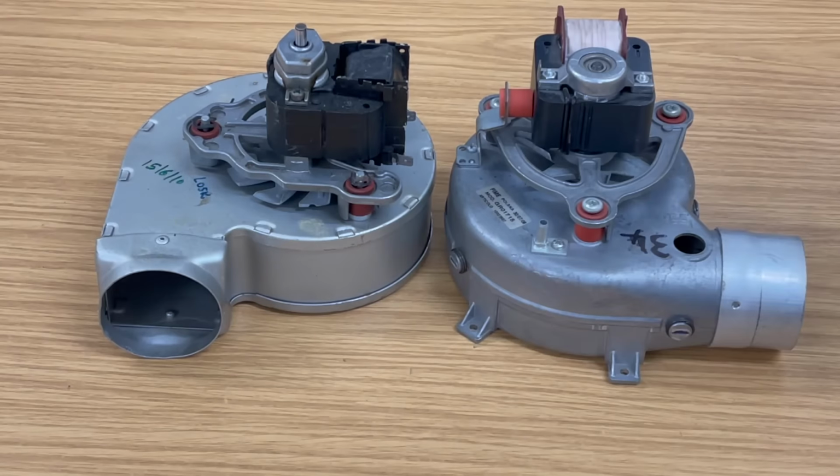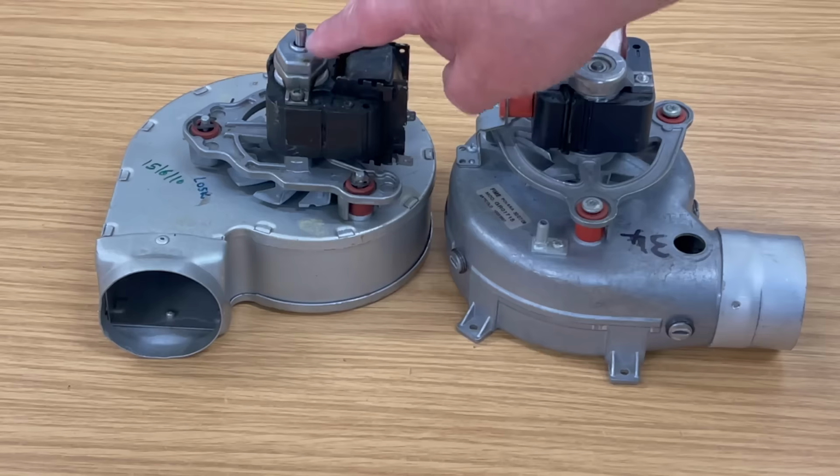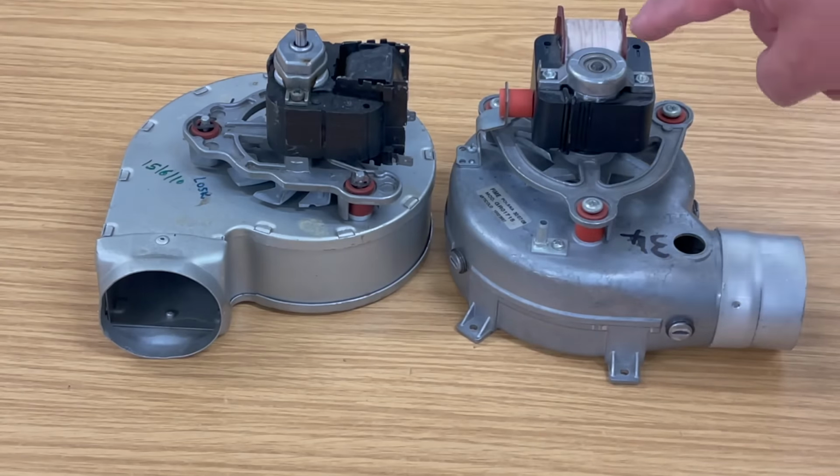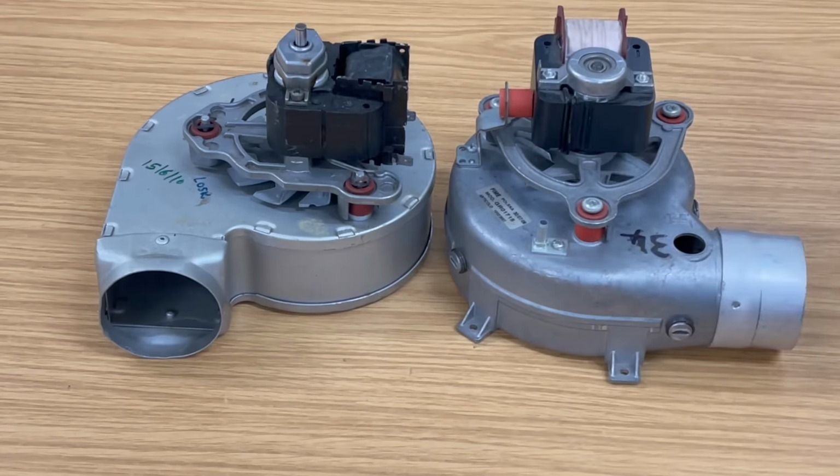And the problem is these bearings here. And there's another one down below, and one here and one down below. This one we can get to very easily. We can clean it out and put some oil into it and put it back into the boiler whilst we wait for the latest version. Because once this bearing has gone, it will come back.